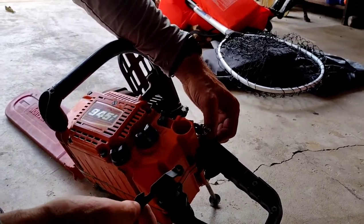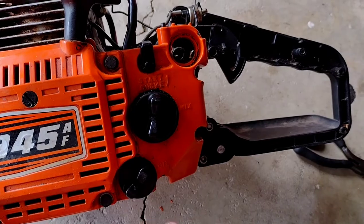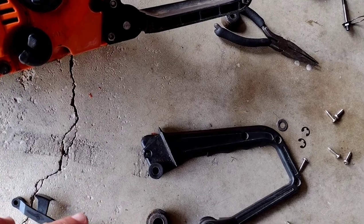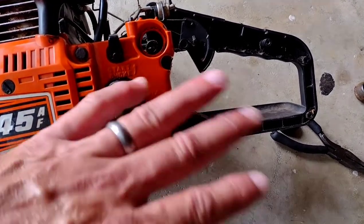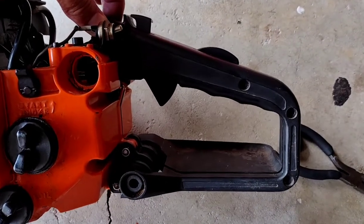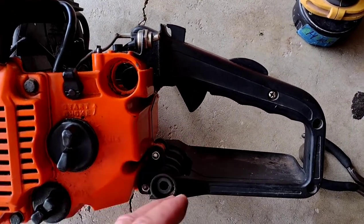If you're working on this old saw, this is going to be a great reference. So next I'm going to put that back in just like I showed you. Getting the grommet in with the handle piece — I'm telling you, it might be a two-beer job because it's going to test your patience. Once that's all back together I'll slide the pin through. My suggestion: before you do anything else, once you've got it pinched together, put one screw in down here just to hold things together so you can use two hands.